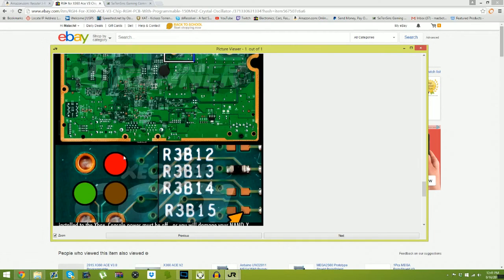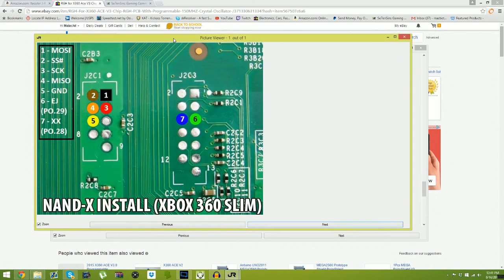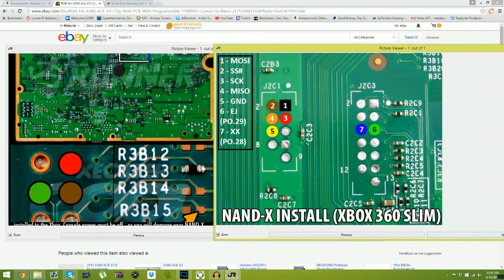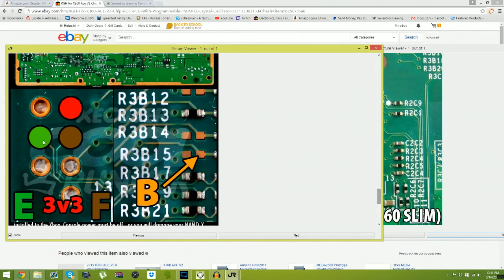Now let me tell you something, guys. See if I can get a better image. Index. So as you're kind of looking at it, this is what you're looking at. Now follow me closely. As you can see, right under the green is where you'll solder your 3v3. That's your red wire. And then right under it, you'll solder your brown. I used to screw this up all the time. Your brown is your F wire. Do not think it's your green wire. It is your brown wire. Then right next to it, it will be your E wire.